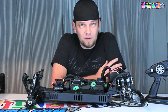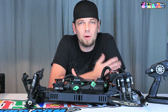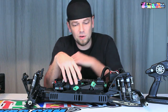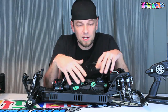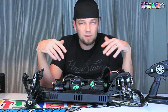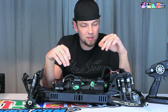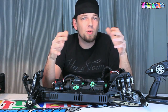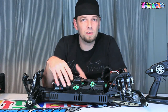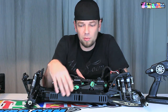After that you're left with a lot of wiring. There are several different ways to go about it. If you read up online, some people prefer soldering stuff up in parallel. I just decided to go with a regular setup — I put them in series: one for the front, one for the back, not going parallel and splitting it out again afterwards. You risk draining your battery that way, and if there is a tiny performance difference in the batteries, it won't be that big of a deal as long as you run similar batteries.